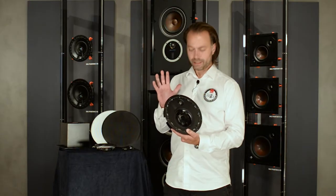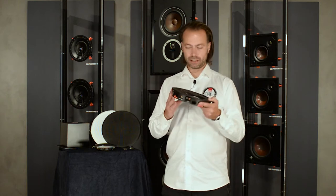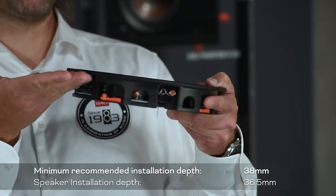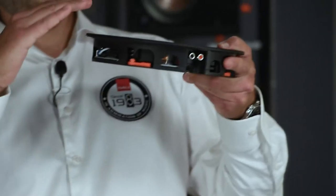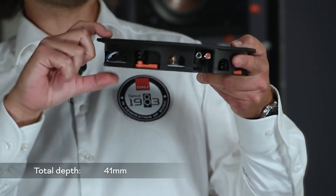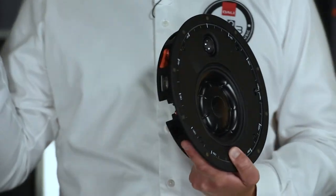Let's dive into some of the details of the new K60 LP. First off, the main feature is the low profile installation depth. With a total installation depth of 38 millimeters from the back of the speaker baffle to the rear of the speaker, the K60 LP is amongst the most shallow in-ceiling speakers available. Measuring from the front to the back of the speaker, the K60 LP has a total depth of only 41 millimeters. This makes it extremely versatile and able to be installed in places where normal CI speakers would never fit.